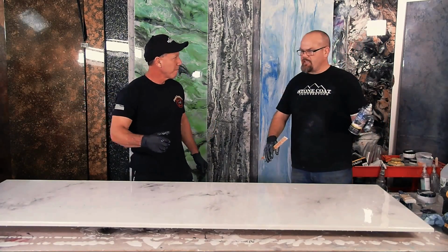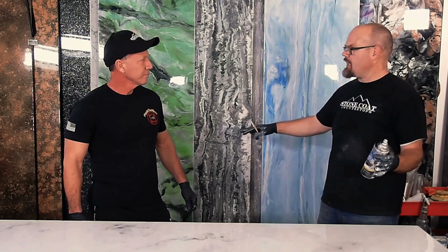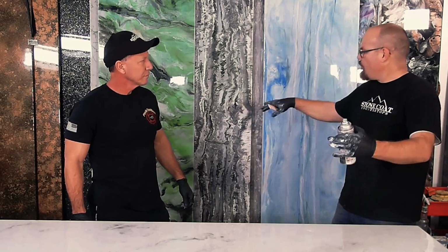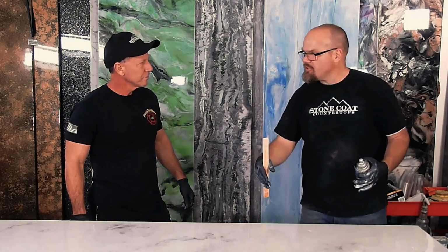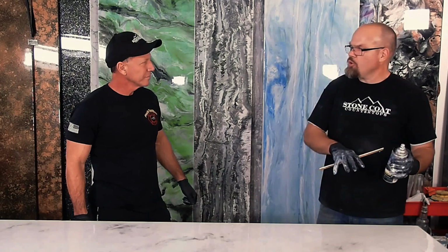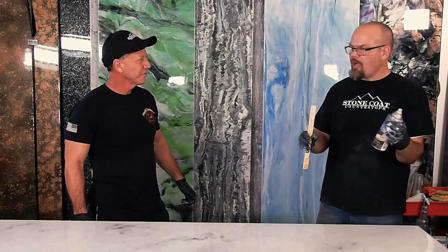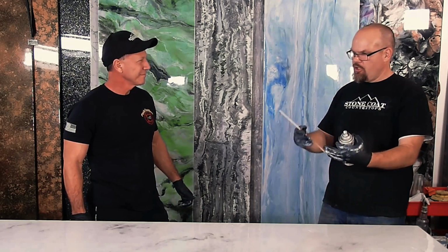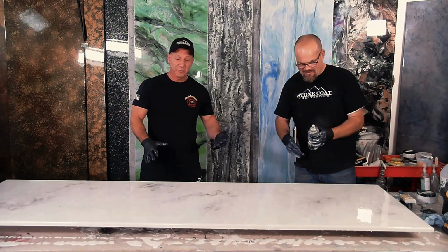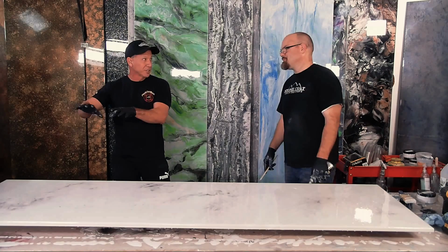When we're doing a big kitchen, we'll prefabricate everything in MDF. We'll pour it all as one, even if it's a U-shaped kitchen, and then we'll cut our new seam where the sink or the stove is, where it's just going to be a little seam, and when you look at the grain and the pattern, your eye will not know. Like in granite, you can pick up that seam. This is a way around it, and it's hard. You know how many times you're trying to line up seams to make it look as good as you can.